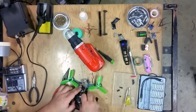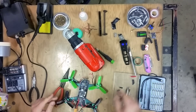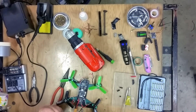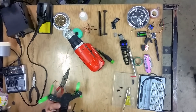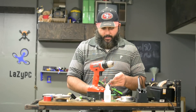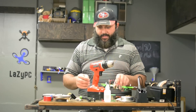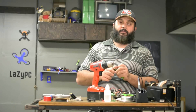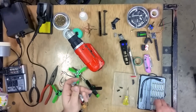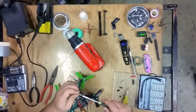Now that that is done, let's get it mounted. Basically what we are going to do is instead of mounting the PDB underneath, we're going to mount it in the middle on top of the carbon fiber, then use these longer screws and drive them all the way through — carbon fiber, then PDB. What you are going to lose is the middle front screw unless you want to drill a hole through your PDB, which doesn't sound fun. So I'm just going to use the four mounting posts.